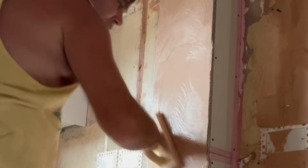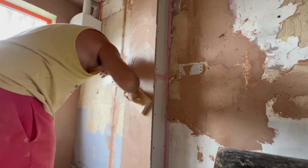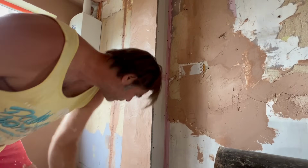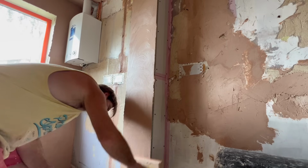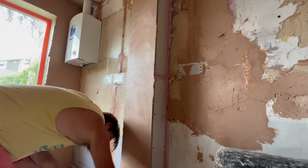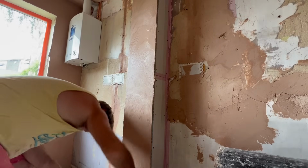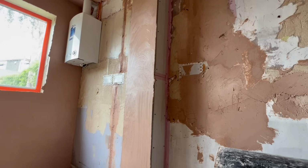It's kind of like putting 2 coats on. What we're doing is mixing and knocking back the second coat whilst it's on the wall, not in the bucket. I'm only doing it on the face of this, just to bring it in line with the rest of the set at the bottom. And it's a small area, so I can give it the attention it needs.